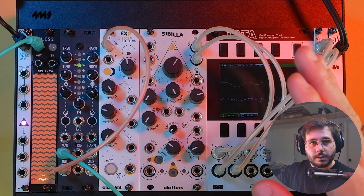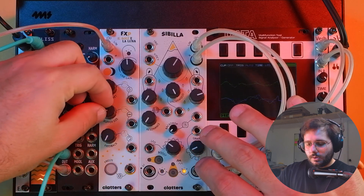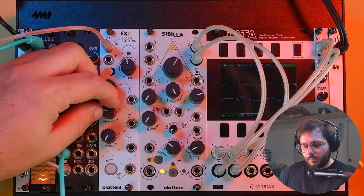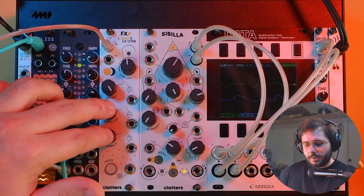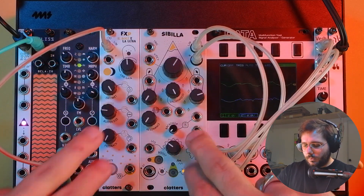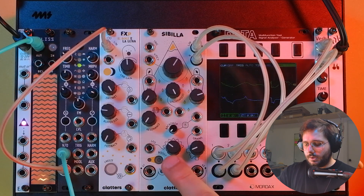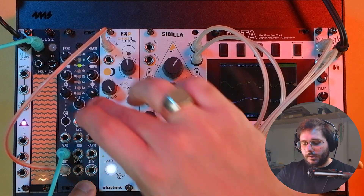In addition, Sibilla's sampling delay network is now completely open and can be modified by the user. New controls are the buffer size, which controls the real-time sampling window length of all the audio sampled into this buffer — approximately one second long. Then we have the feedback control, which controls the amount of sampled audio sent back into the audio loop for the pitch-shifted tracks. And the grain knob, which controls the starting position of those sampled audio bits. The grain control still needs to be activated with a double tap on the center button. We also now have a freeze button, which freezes the buffer.